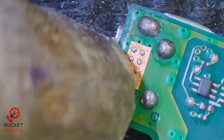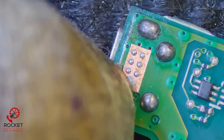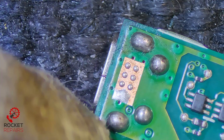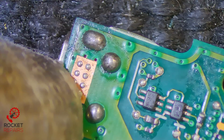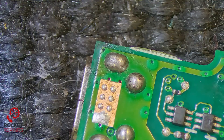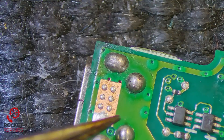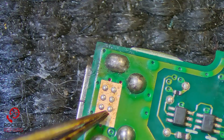If you look at the back of the port, this is the ground pad that has been ripped off on the other side as well — so we've lost that secureness. The solder at the back doesn't look too bad, but I'm just going to have to go over the whole thing. If I apply enough heat to the back here with my soldering iron, the solder should push through to these ground legs, creating a much better bond. I'm going to put pressure on this port with a pair of tweezers, then heat this area up and go over the connections.